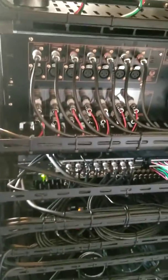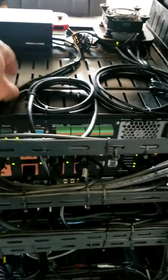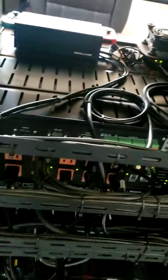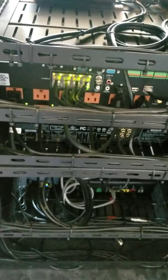As you can see, I try to service loop as much as I can to allow for future expandability. All my wires here are completely cable-combed — I like everything to be straight, nice, neat, and tidy. A lot of racks get crazy quick with things going everywhere. Coming down further, you can see more of the service loops feeding all the gear. Everything's nicely managed with zip ties — I make sure not to apply them too tight so I can quickly cut things if I need to. Going further down we have our NVR for cameras, plugs for devices into the OVRC brain, and our network switches.